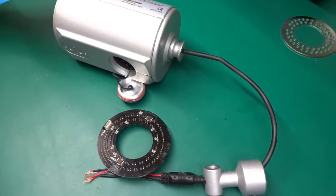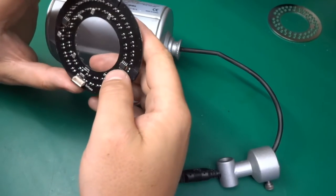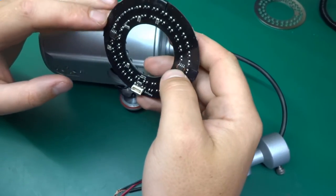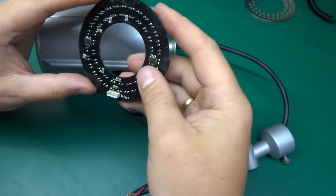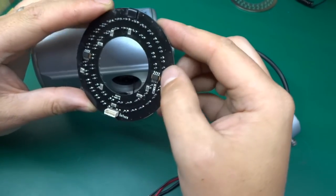Unfortunately, a very quick search on Google didn't find anything on this chip. Now I am finding suppliers for this from China for MB1102G, and it correctly states it's an 8-pin SOT package. So this chip does exist. It must be something obscure. It's probably some sort of LED driver, constant current driver, I think.